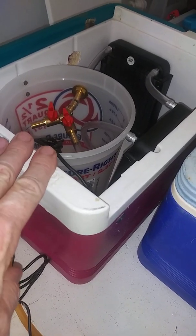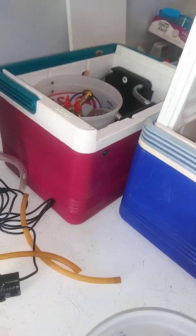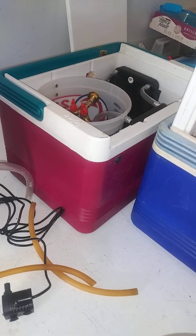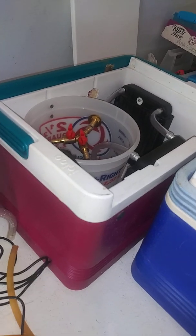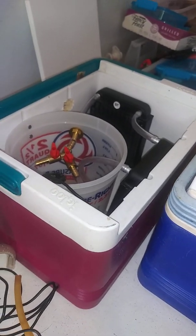You could run this little nine-quart open loop — without it being closed loop — on medium. In van life or something really small where you just want body cooling and not cooling the room, you could easily run that probably 45 minutes to an hour. On low to medium you could get an hour out of that, and that's with no extra insulation, no extra modifications, not slowing down the water flow — which is another way you can preserve your ice and lengthen the cooling time. So you could easily, without really going overboard, get an hour out of that little tiny thing.